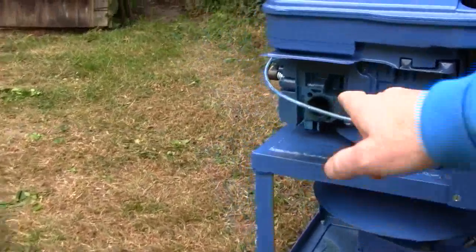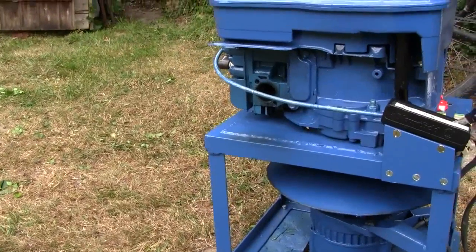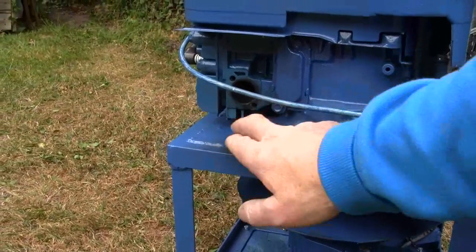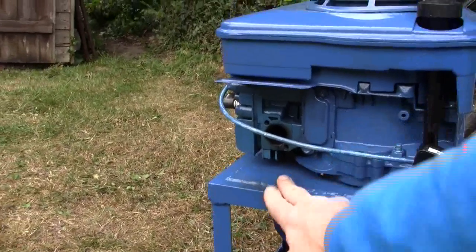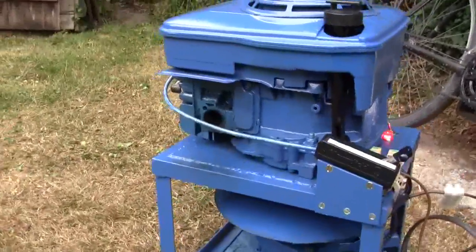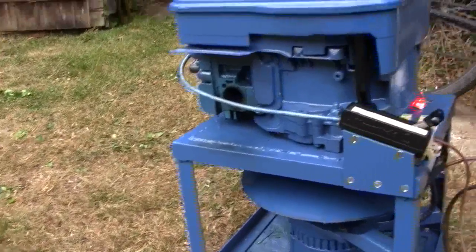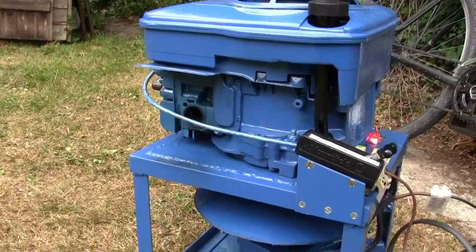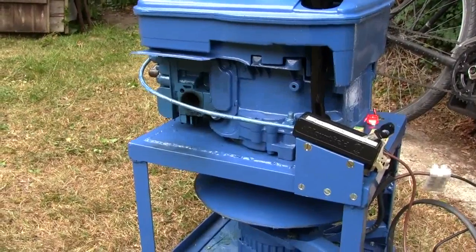The other thing I might do is put an exhaust pipe on it, because there's no exhaust at the moment and it's quite noisy. What I might do is get a little elbow pipe with a flange coming out through the diaphragm, then an expansion chamber underneath, going onto a short exhaust pipe. That should silence it quite a lot, because being four stroke it's not too sensitive to back pressure. So I think that's about it — thanks for watching.